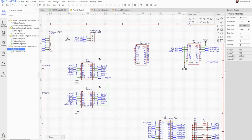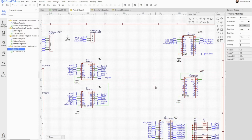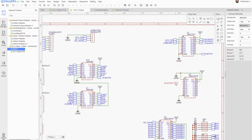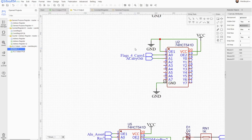And we actually had a second line driver that we were using to buffer all of our flags. On the breadboard, it's the second line. We may want to reorder these a bit for routing convenience. So the first flag in the display we've got at the moment is logical carry. So I'm just going to feed that through one of these, just so we can guarantee a nice even brightness.